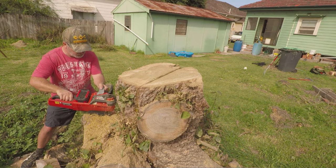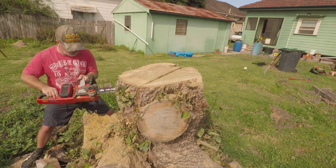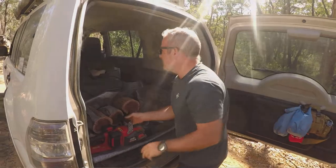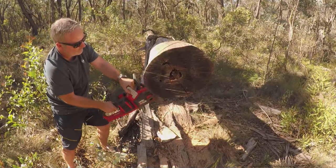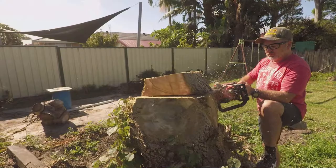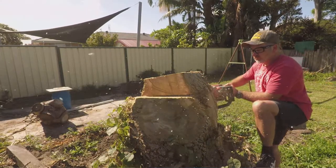People are going to ask about the battery life. I was a little bit surprised that the battery didn't last quite as long as I expected. Up until yesterday cutting the tree stumps for Eddie, I hadn't actually run out of a set of batteries — I'd used it lots around the yard on four- to five-inch stuff, and camping over a couple of days, relatively small stuff. We were probably only cutting maybe 10 to 15 minutes at a time, so realistically probably only half an hour to 40 minutes total. But pushing this into service on big timber, it was hard work. The way I was cutting, it was getting a bit of pinch, so it was really having to push to turn. I probably got around about 45 minutes to maybe an hour out of it, but I really shouldn't be surprised given what a hard job we were asking of it.